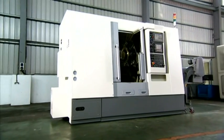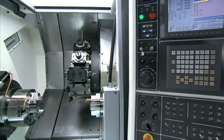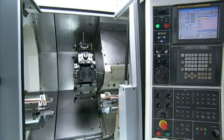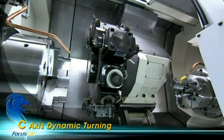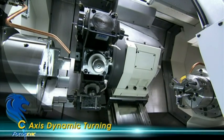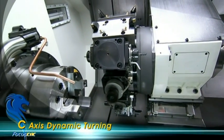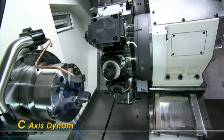The newly designed BMT-60 12-tool high rigidity power turret features a greater coupling diameter that gives you higher rigidity and deeper cutting without risk of chattering. The BMT power holders on this model are top of the line high rigidity models which feature a 1-to-1 drive ratio and up to 4000rpm. Along with the special low-interference design, this makes it a very versatile machine indeed.